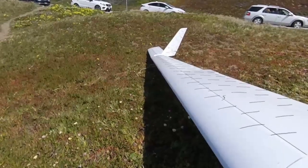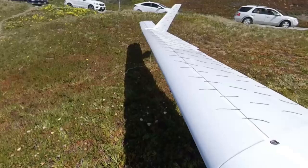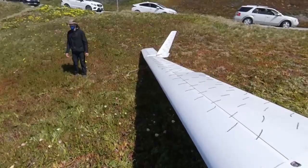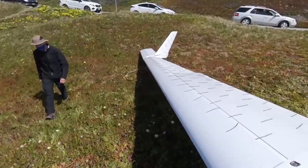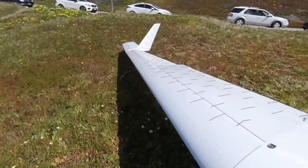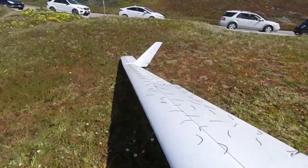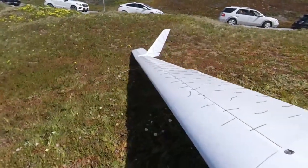You'll see the elevon moving up and down as I attempt to balance the wing in roll. Overall, when the conditions are smooth, I was able to fly the wing in place. But we had conditions where the wing is down, I have the elevon down with a lot of roll control put in, and I'm trying to lift that wing up and it's coming up very slowly. We were very concerned about this on site because it seemed the ailerons were very sluggish.